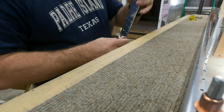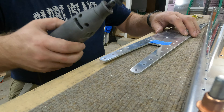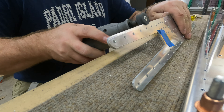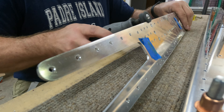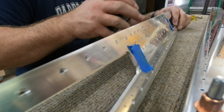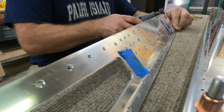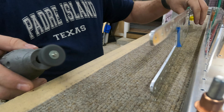Here working a little bit on the inside edges with my deburr tool where I couldn't quite get with the Dremel. Here's a slower shot of that deburring using the Dremel — you can see I can just quickly go along the edges and deburr as I go. I can use other sections to get the large knobs on the edge of the doubler, but using the Dremel and the 3M deburring wheel really speeds things up.